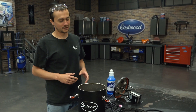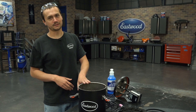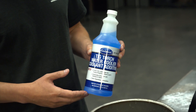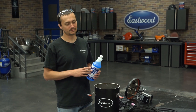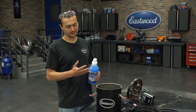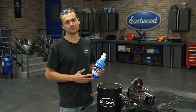The first part of this setup is getting our water-coolant mixture just right. We've already got about 150 ounces of water in here, and we're going to use our TIG torch water coolant. We recommend a 10-to-1 ratio, so we're going to use about half this quart. This TIG torch water coolant isn't a must-have, but we highly recommend it if you plan on keeping your whole system filled, because it eliminates corrosion and buildup in the system and also gives some freeze protection down to 26 degrees.